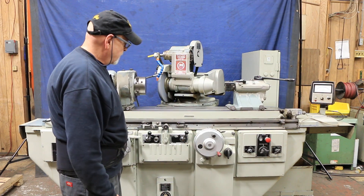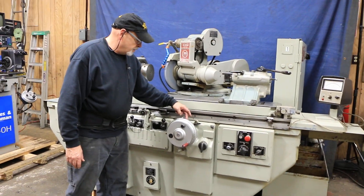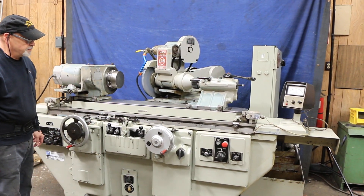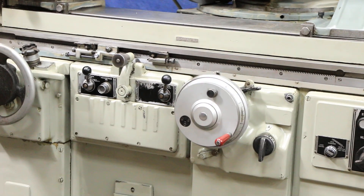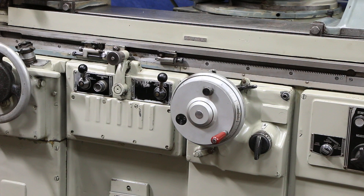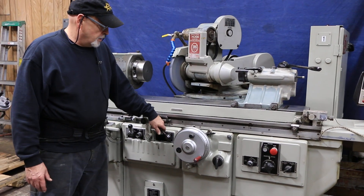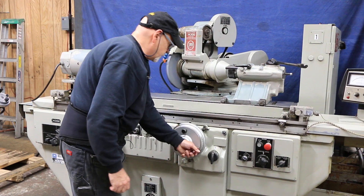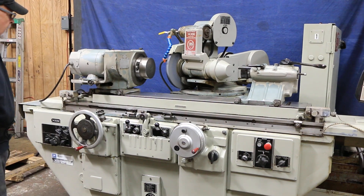We'll start the feed and that will feed down. You see here is the dead stop - it's going to come up against that solid pin there and stop at zero. On this particular machine there's no automatic retraction. You basically have to back it up yourself, maybe give yourself one or two turns, and then you can come in here and take your workpiece off.